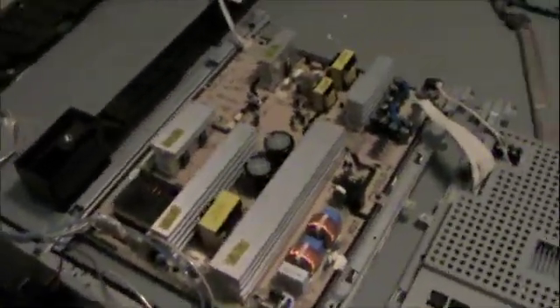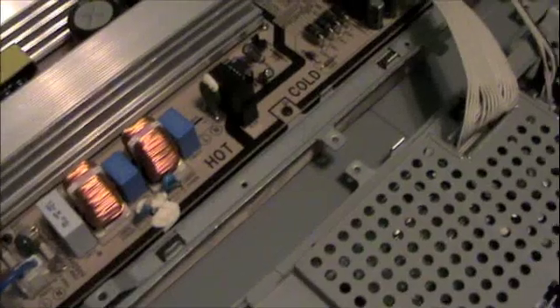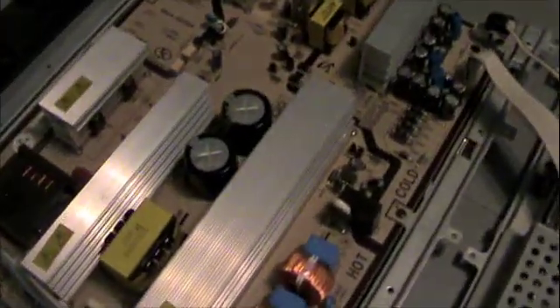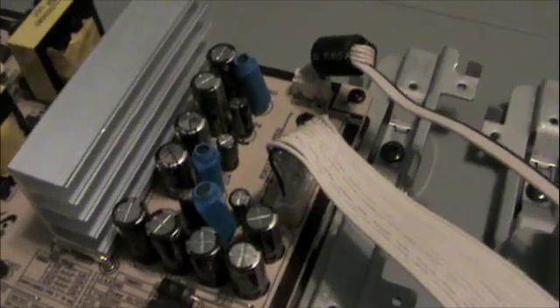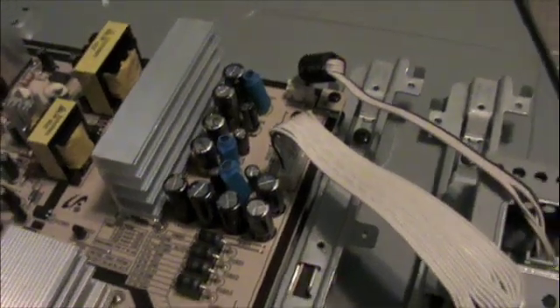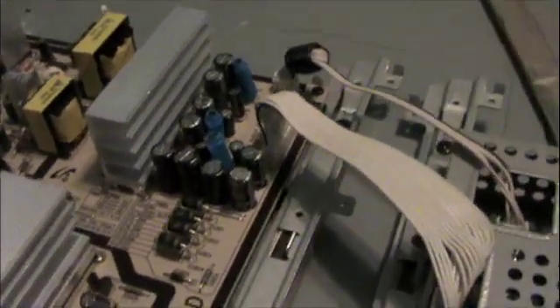We've removed the cage from the power supply. Taking a quick look, there are seven connectors holding the board down along with screws along the perimeter. Samsung has marked the AC and DC sides of the board as hot and cold, so when working on the board make sure you're handling the cold sections in case there's any residual charge on the large bulk capacitors. Looking at the bypass section of the power supply, we can see two obvious electrolytic caps that have bulged and are leaking electrolytic fluid — just as described in the forums by several other users. We're going to remove this board and replace all the 1,000 microfarad caps with a 10-volt rating, including the other three caps in this section, so we don't have future problems.